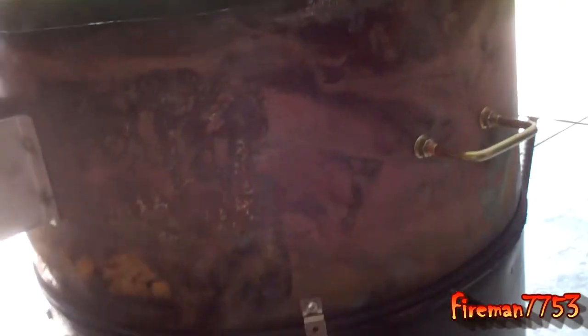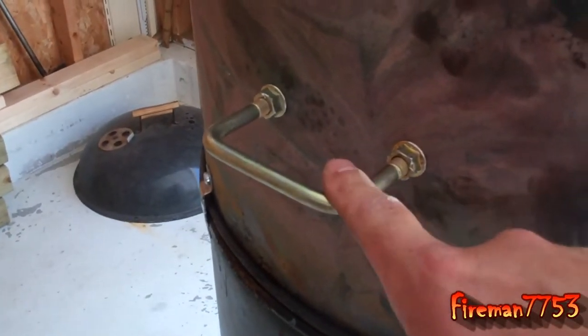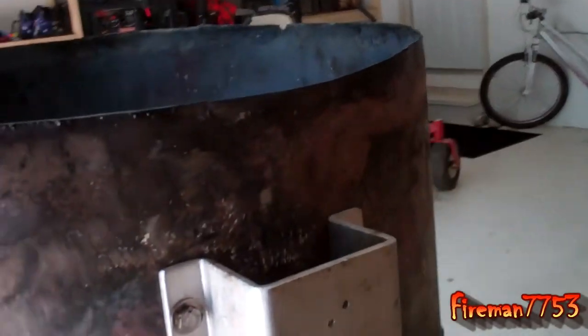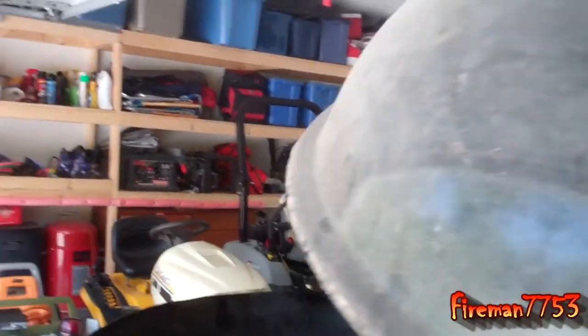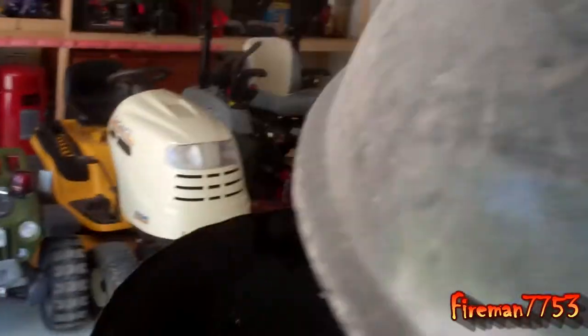Check it out, guys. Here's what we did. It goes lip to lip, and then where you cut, that goes to the top. I had a couple of brackets here — a couple of U-bolts that I made some handles with on both sides — and this is the piece that my little spit motor mounts to. I'll show you that later. I'm actually going to burn it off real good and then paint it with some heatproof paint. There's the other side of the spit, and I put little tabs on — just some little metal brackets I had that I bent. You can shake this thing around and it's not going to go anywhere. The Weber lid, because it's the same diameter as a barrel, just sits right on top. See how this is all coming together? I'm almost finished.